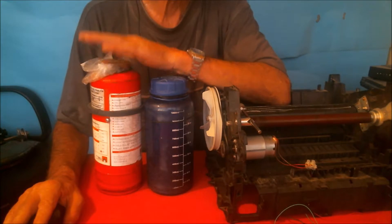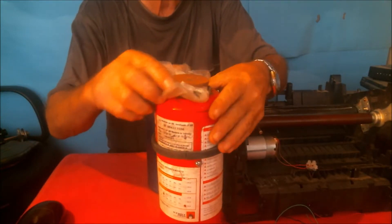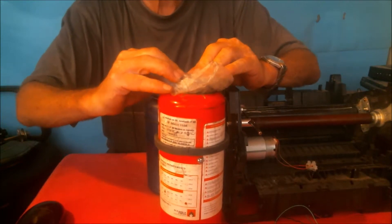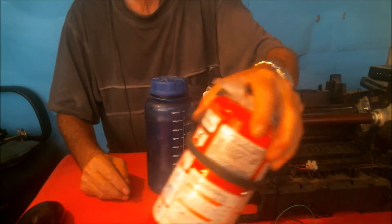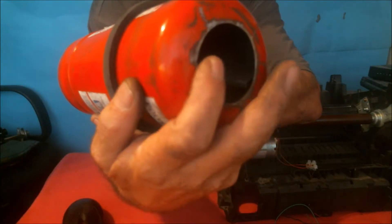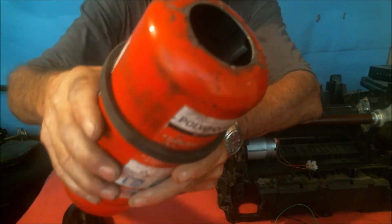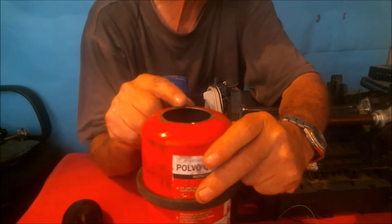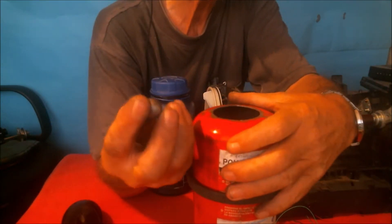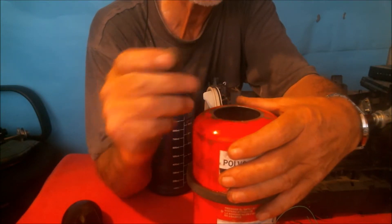Mill jar or cylinder — my mill jar for grinding is an old thick-walled fire extinguisher. I cut off the nozzle to just the right size for a laboratory cork. This cork has some holes in it and I put plastic there so the dust doesn't come out while milling. The inside of the jar has a mechanism to drag iron balls around, lifting them and making them fall onto the material that has to be ground. The grinding balls were taken out of oversized ball bearings and are quite small — they could be even bigger for this jar.